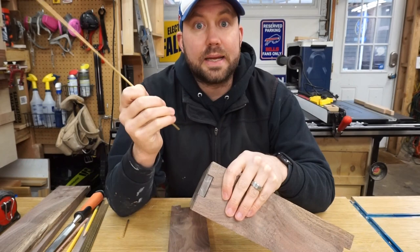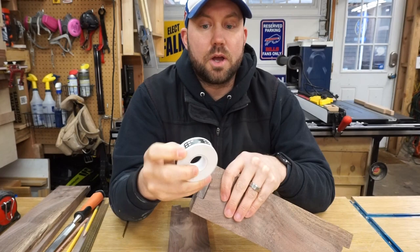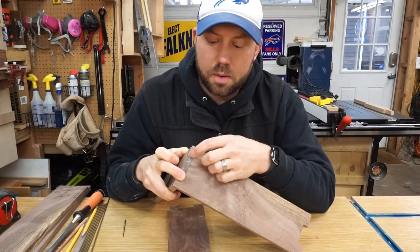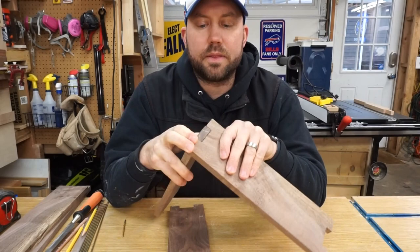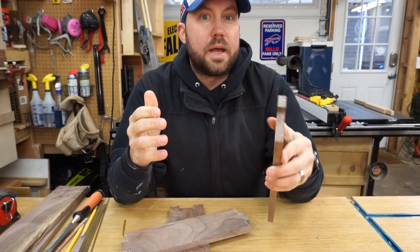So what I was thinking is using this, which is an eighth of an inch thick, and then mimicking the Shaper tape here, which has these different dots within rectangles. I'm just gonna use it as a way to further strengthen these joints by creating almost like little mimicked Shaper Origin tape on the different joints here, which should be fun. So the next thing I'm gonna do is clean these up and then route out the grooves that are gonna accept the bottom, which I will need to glue up and put together here with the remaining walnut planks.